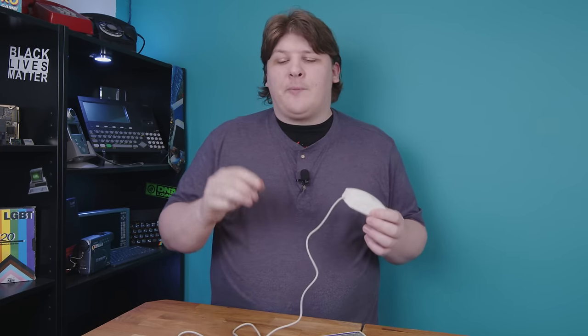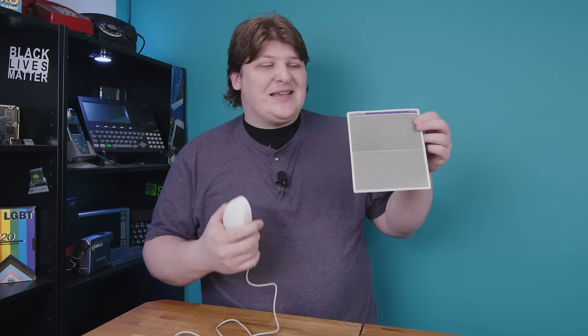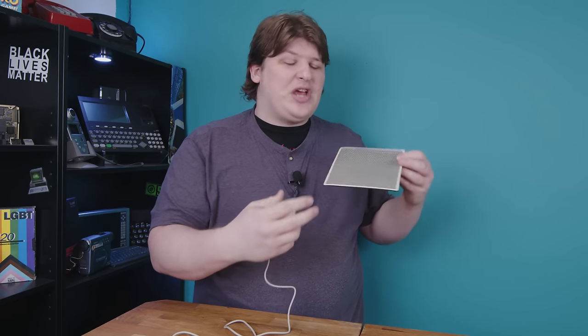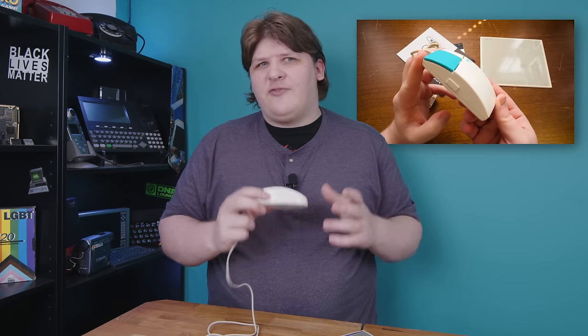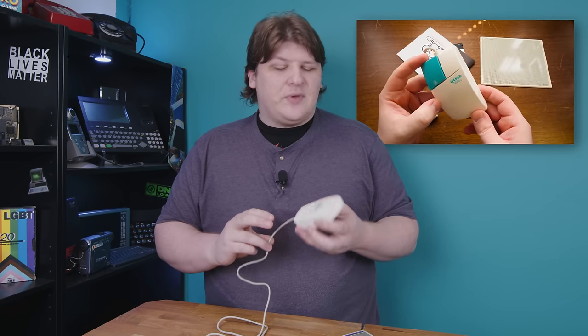I had sort of figured that these might actually be pretty much the same mouse, just with different firmware. I should mention in the previous video I had proposed that this might actually be using a ball mouse controller chip, and that the special mouse pad it uses is actually a rotary encoder that's been unrolled into a linear shape. But a number of people commented and made fairly convincing arguments that that was not possible, which is fine — it was just a fun little theory. The much more likely case is that this just has a microcontroller in it. So I thought that LGR's mouse was pretty much like this one, just with different code. However, shortly before I finished my video, I realized that I had missed something — his mouse has a lot more fiber strands on each sensor than mine does, and that suggests some more radical internal changes.